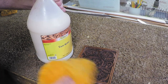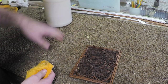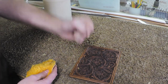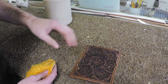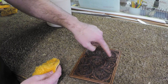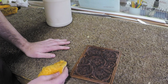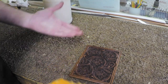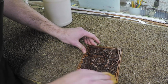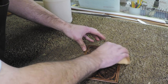I take the Tan Kote again — the same finish we used as the resist — and go ahead and put one last coat on here. You can let this dry completely overnight or a couple hours, but it doesn't hurt to do it right after antiquing either. The only thing: if you're going for really dark, heavy contrast in the background, let that dry completely first because we are going to lift even more antique out right now. Our goal is just to get the antique off the raised areas — the high spots on the flowers, beams, vines, and scroll work. We're basically washing the high points.